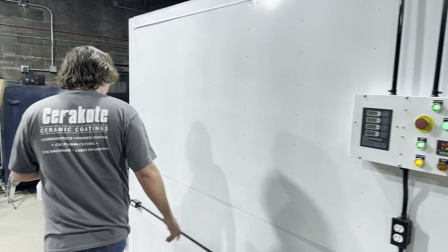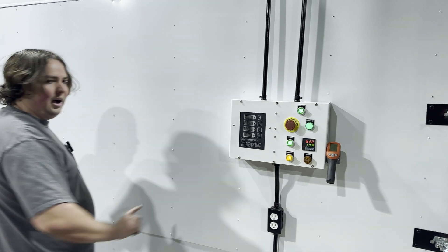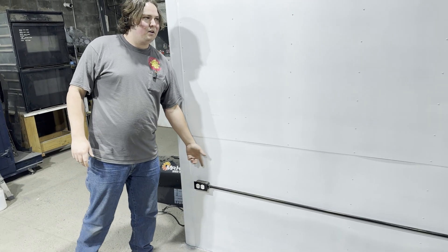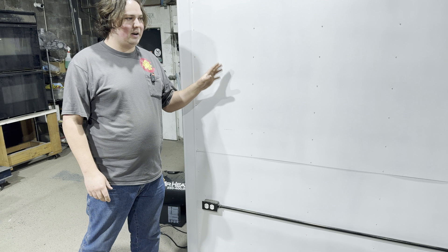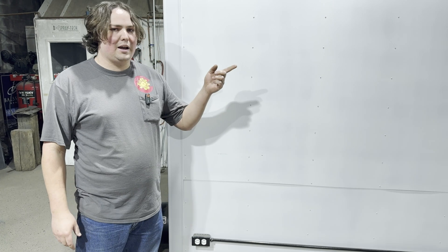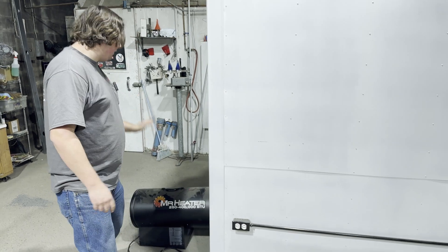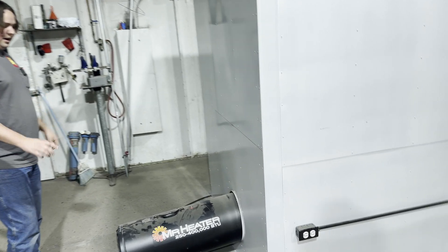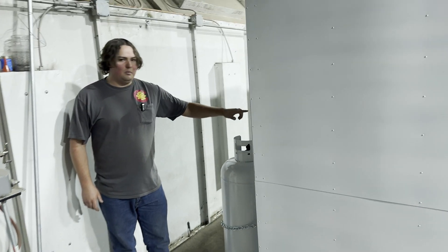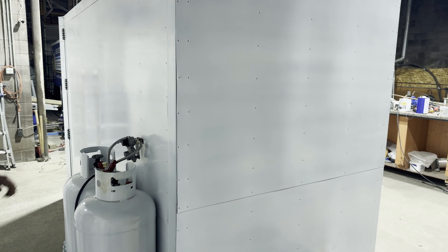The PID powers the outlet down here, and this is where our Mr. Heater would be plugged in. This is our switched outlet for the PID — so when the PID detects the temperature is too low, it gives power to this outlet which fires up the Mr. Heater. And this one runs around the back to our double-feed propane system.